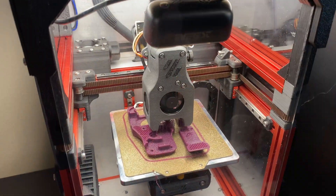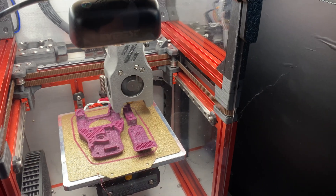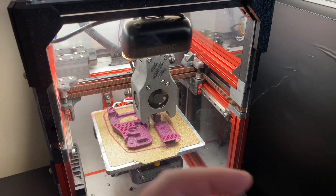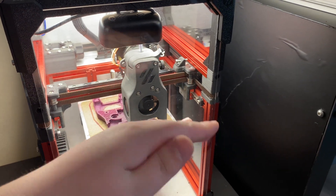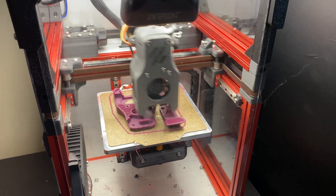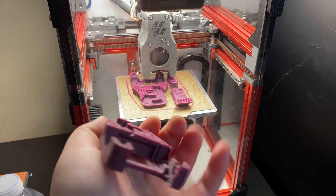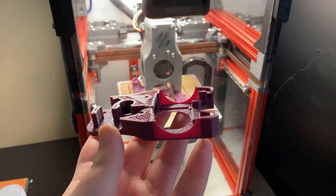It works. Now I want to talk about print quality problems. Basically I had four print quality problems and two of them I managed to fix. One of them was about the layer lines — that was about the X-axis rail because the tool head was wobbling front to back, as I said at the beginning of the video. That is fixed. Another problem was the hotend getting clogged at some point — the extruder stopping extruding — and that was a pretty simple fix: I just had to increase the temperature.